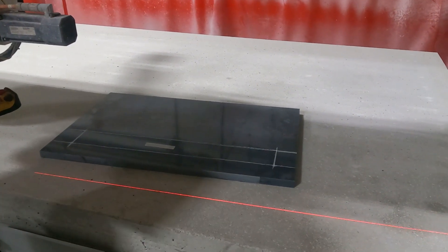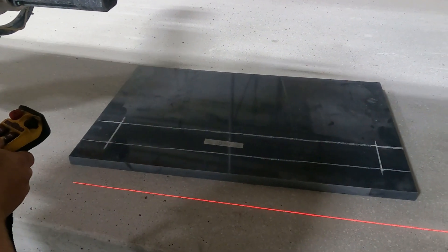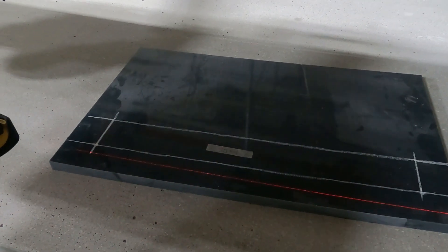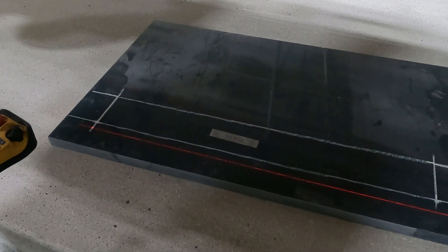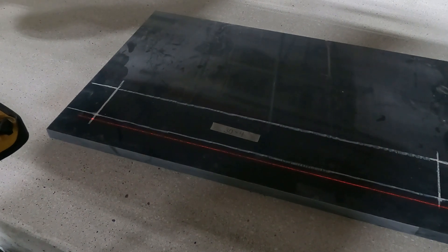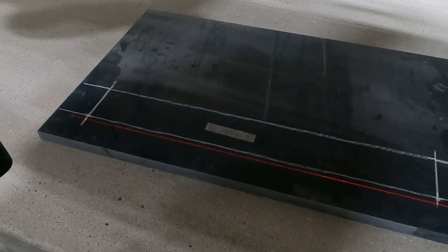I'm going to go C plus so that the water doesn't spray me towards the monitor. I'm going to use Y to get relatively close. I'm going to use the slow button in C to keep aligning until the laser looks relatively equal along that white line, and then I'm just going to scoot a little bit closer in Y again as well.